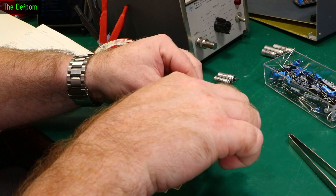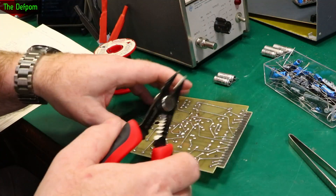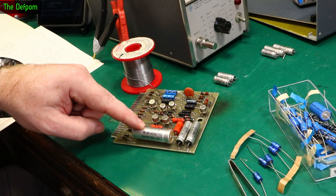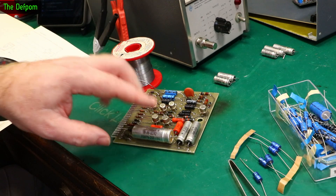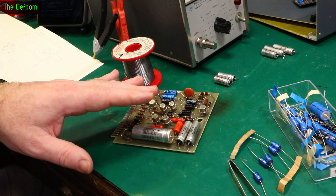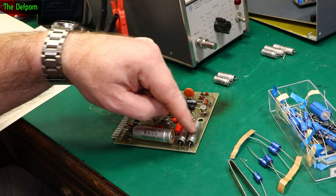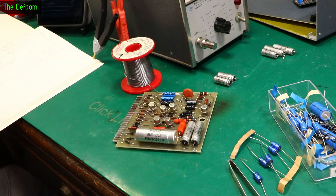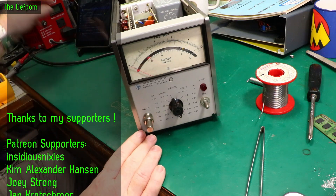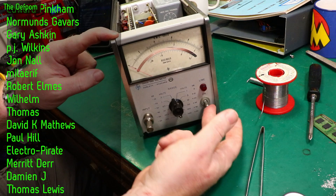The next two caps are installed. I might do some extra heating on the top side because the solder hasn't flowed across the pads as well as I'd like. I tested one removed cap and measured 0.6 ohms at 42 microfarads - that's absolutely fine. I don't have a replacement for it right now so I'll leave that one. These two measured 31 ohms at 17 microfarads both - they're both way high, so those are going to be replaced. I've done the caps on that board apart from the big one. Let's power it up and see if there's any difference.